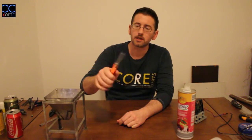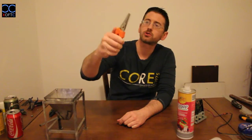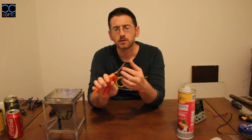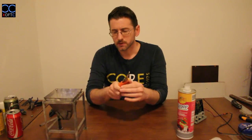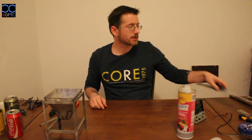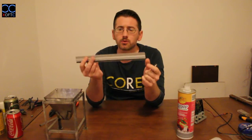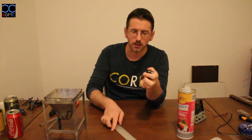I have a smaller scissors here — it's not a dedicated tool, it's a gardening tool, used as a hedge trimmer. It allows me to make more delicate cuts and cut circular and elliptic shapes. When I'm cutting straight lines in the material, I use an aluminum ruler. It can be any straight piece of aluminum you can use as a guide.